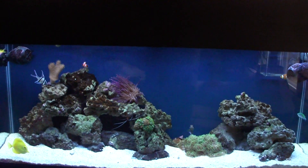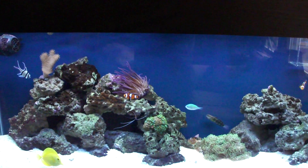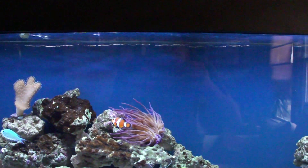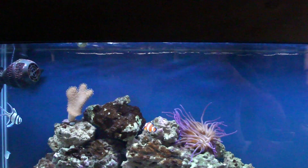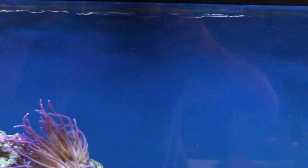We did have one issue though. I probably wouldn't have this problem if the tank had been painted beforehand while laying down. I could not get real close to the edge with my roller — I'd probably have to touch that up with a sponge brush — so it kind of left this line, which kind of stinks. Keep that in mind if you're going to paint a tank when it's already set up; it would probably come out better if it wasn't set up.